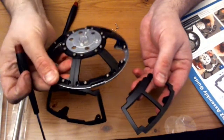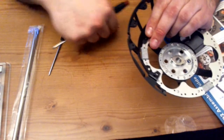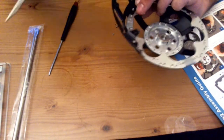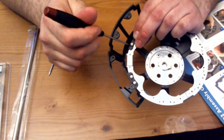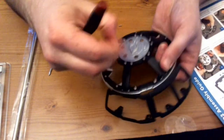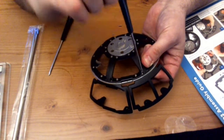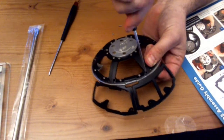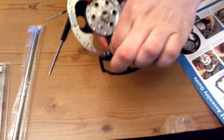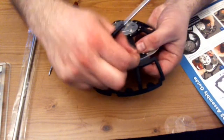Just to the left there. Same deal — we put a nut in the top, hold that in, and then drive the screw. Sorry if you can't see, it's a bit fiddly. There you go. Then you just drive the screw through the top — that's one. And the same for the second: nut goes in the recess, then screw in the top.